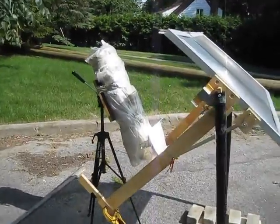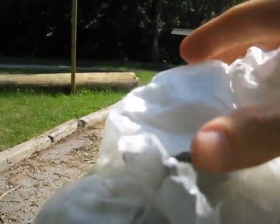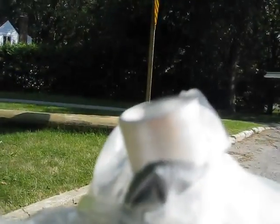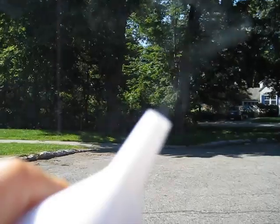Here's the test setup. I can definitely feel heat coming out of the top, but I can also see smoke as the caulking is burning — not sure if it's caulking or carpet tape, but something is burning. There is definitely smoke coming out of this chimney, but not really any airflow to speak of. Definitely hot air — I can feel it coming out. At the bottom underneath, a little bit of heat. On the first day of testing, smoke was coming out of the pipe because smoke from the melting plastic was getting sucked in at the bottom, which was good — otherwise I wouldn't have seen any result at the top. I also tried with a funnel on top to increase output speed and pressure.